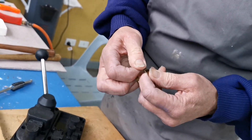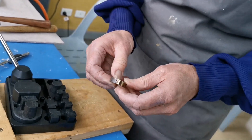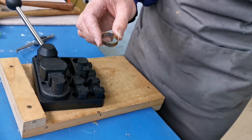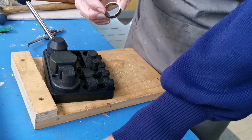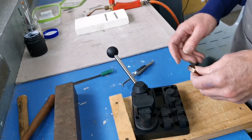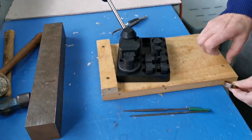The next thing to do is to make sure that the ring actually joins very accurately and smoothly for soldering — that's the next phase of this process. I'm not going to worry so much about the shape because I can use the ring mandrel to really get that perfectly circular. To do that I'll use some files and some sandpaper.